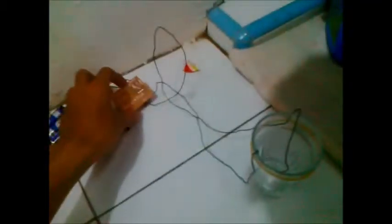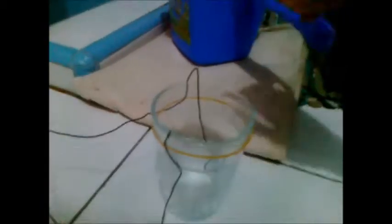Let's check it out. In this glass I have two probes. The first probe has its conducting part at the base of the glass — I could put it anywhere, but it's better at the base. The second probe is near the top. When water fills the glass and reaches the top, touching that conducting part, the circuit rings.